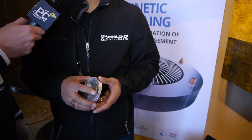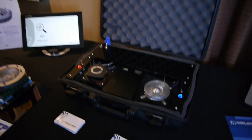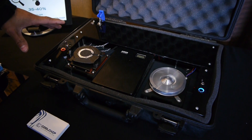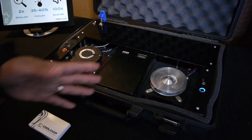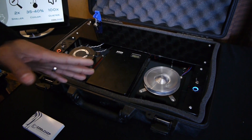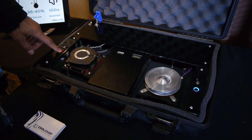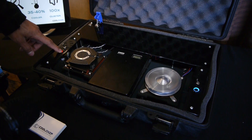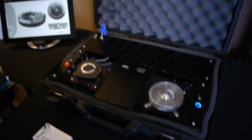You can see a comparison for what the status quo looks like today right over here, where we've got a server cooling commercial product. You can see that the form factors are roughly the same. On the right side, you see the kinetic cooling device. At this RPM, we're removing more heat, and if you could hear the audio, you'll notice there's about a 20 dB delta between the commercial part and the Cool Chip part, and we're still removing more heat.